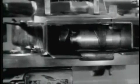In the M-60, the round is stripped from the belt link in a single forward action by the upper locking lug striking the rim of the cartridge, moving it forward. The link is firmly held by the front and rear cartridge guides and cannot move forward with the cartridge. The nose of the round is guided down into the chamber by the chambering ramps.